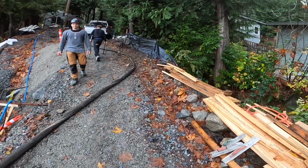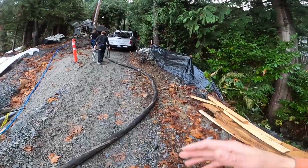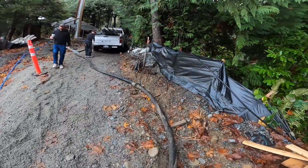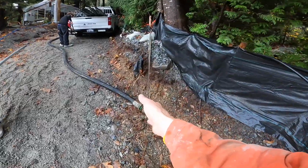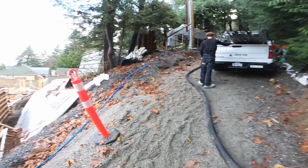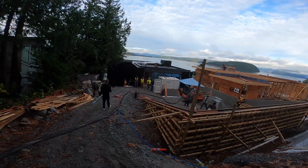You want a bucket of thick primer butting up against the concrete, and then a little bit of wetter primer ahead of it. There's other techniques as far as running plastic bags over the ends of the hoses to hold the primer back, etc., etc. Today we're going to keep it basic. We're going to keep it simple. We're just going to use a lot of primer, and we'll get it through.